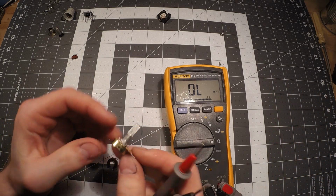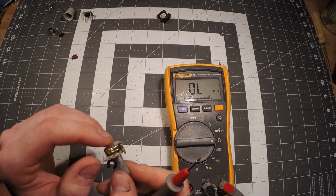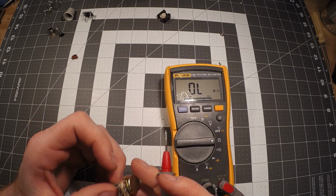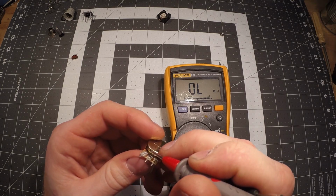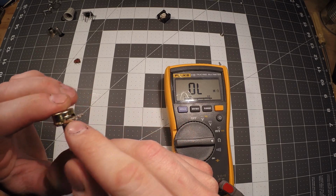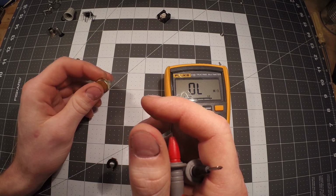This is a newer potentiometer, but it's not a newer style. This is actually a fairly old style as well, and I would be willing to say that probably this older one was built a lot better. However, the way that it's constructed, it's as if they've actually got the graphite material on a circuit board instead of this ceramic material. So it should last longer with this circuit board material. More than likely, it's going to have some sort of fiberglass in it that'll make it last a lot longer, and it won't be susceptible to things like shock from hard drops and things of that nature.